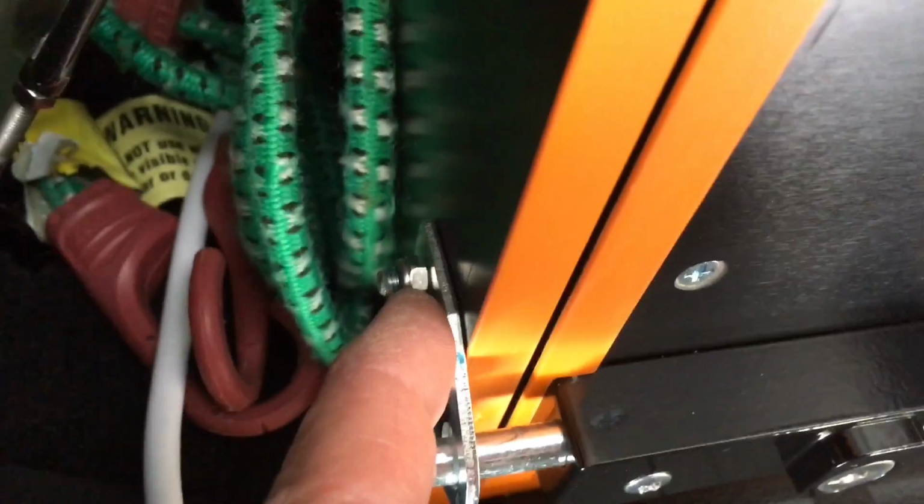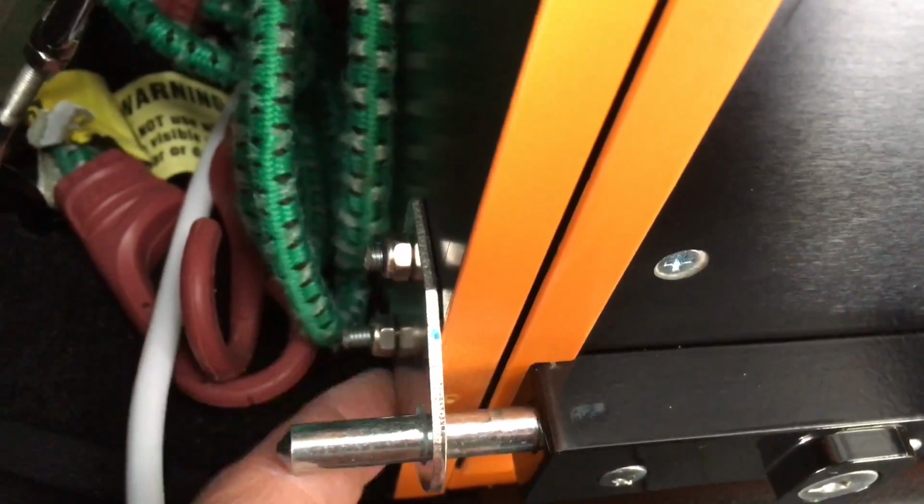So what I did, I actually used bolts. They're countersunk heads into this side of material around here, and I found some matching, I think they were 5mm diameter, nyloc nuts, and I just cut the ends off to make those a bit shorter. Didn't do the most accurate cutting job. It was quick, I wanted to get it done and see how well it works. So it holds the drawer really securely in place, and of course when I want to open it, it's a one-person action, nice and smooth.